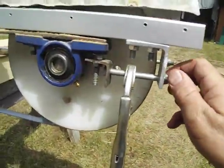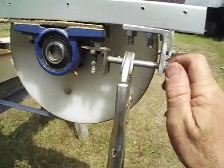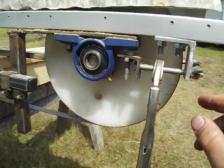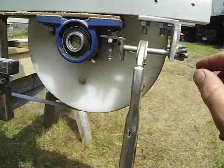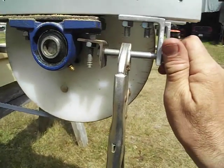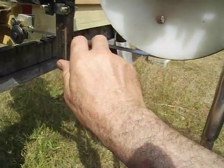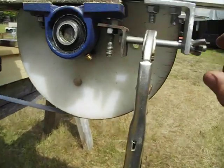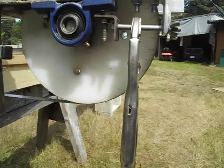Now about the tensioning — obviously it would be good to have something to keep the bolt from turning while you're tightening the wing nut. Also, these wing nuts and the whole assembly are too small. I'd go for at least three-eighths here and bigger wing nuts, because it's a significant torque you have to put on for hand torque to tighten the band adequately. Some kind of knobs that thread on there might be even better.